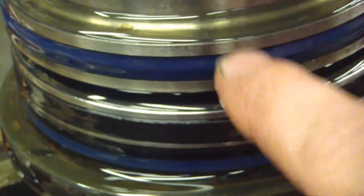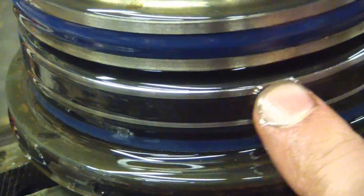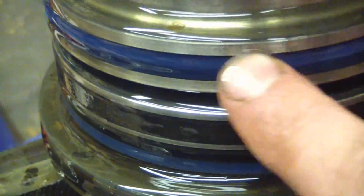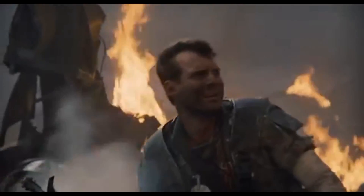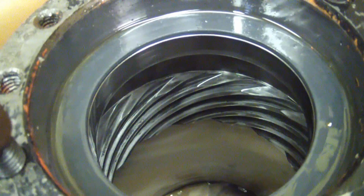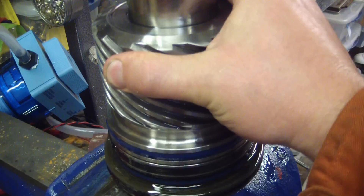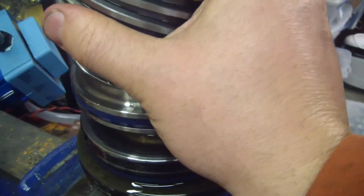Here's the gland. Here's the piston seal — one way. It's the bearing, also known as the wear ring depending on who you talk to. And there's another pressure seal. And here's the money shot — wait, what? Fucking weird, man. Well, that's just great. Here's the body of the rig, and there's the outside helical gear set, which meshes with this inside helical gear set. Show you something that's going to blow your mind — there's another helical gear set.